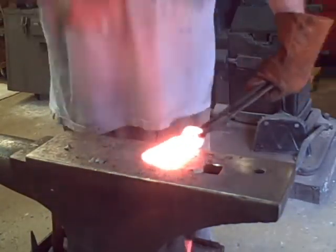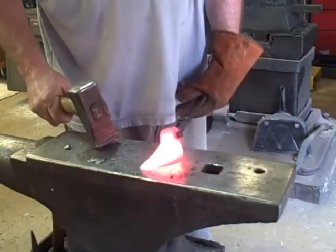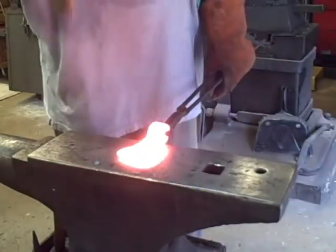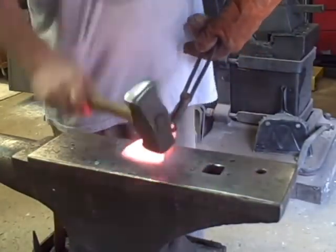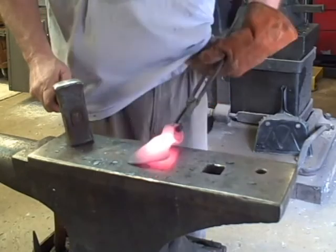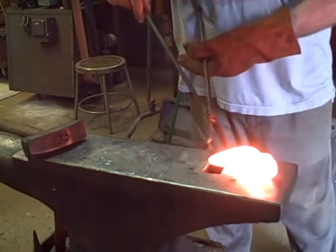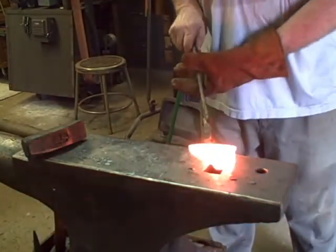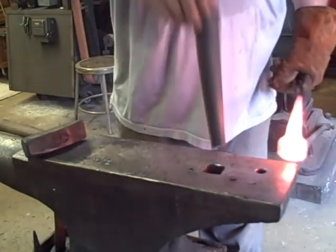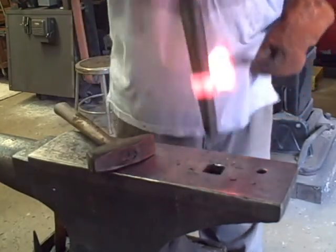We'll speed this segment up a little bit so you can see it being formed. I use the flat side of the hammer — the side that has a little crown — back and forth with the peen, getting the shape and taper that I want. This gets actually pretty close to forge to form. You'll see me use a belt sander on it later, but I don't remove a whole lot. I use that belt sander mostly to shape the outer edges, which a pioneer blacksmith would have used a file for.